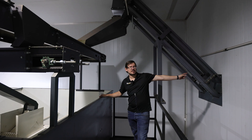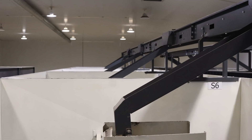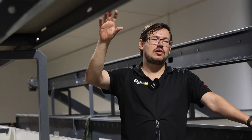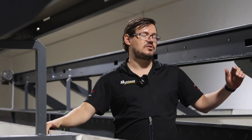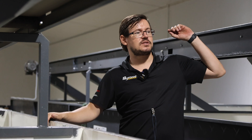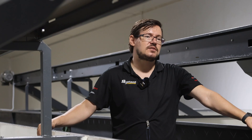The sizer in the final sorting area brings two sizes of nuts into the cool storage area on a split conveyor belt — bin one gets small nuts and bin two gets medium and large nuts. The purpose of this room is long-term nut-in-shell storage without further drying. The air conditioners are very slow-acting; it's not a system that cools the room to 22 degrees within five minutes. Nuts can stay in here for two to three months safely without picking up mold or further damage.